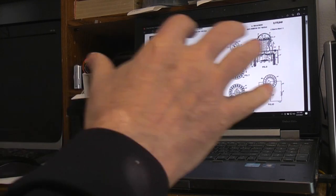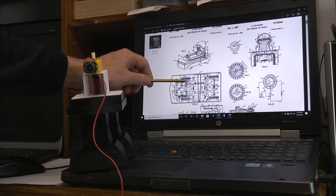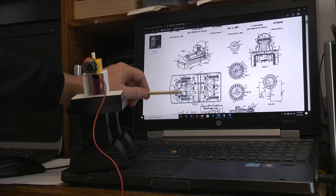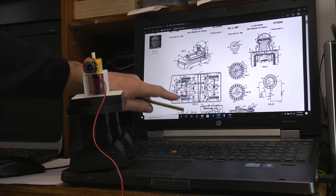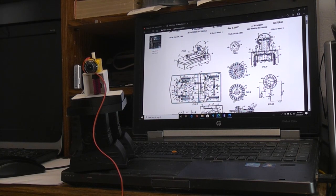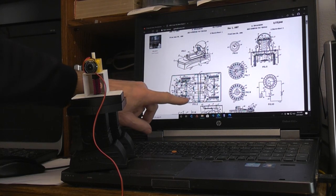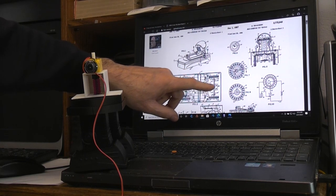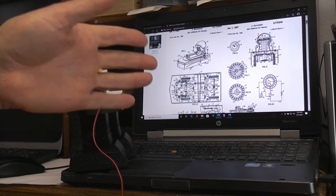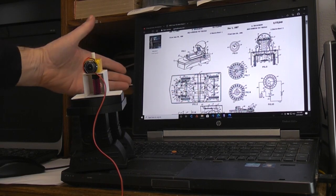But what I found when I was reading the full patent on the mechanics, and we'll talk about this closer, but clear down here in the front drive, see there's a motor for each of the front wheels. And there's a little spring, number 22, and a little spring, number 23, if you bring up the patent and look at it. It'll tell you all about that. Long and short of it is when this toy is operating, only one of these motors is running at a time. So either the left motor is running or the right motor is running. And one of the rear wheels turns a gear which runs the mechanical sequencer. And the mechanical sequencer has the 20 electric switches. And the switches are what tell which motor is going to be on or off.